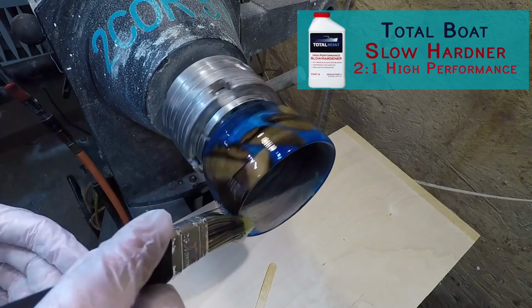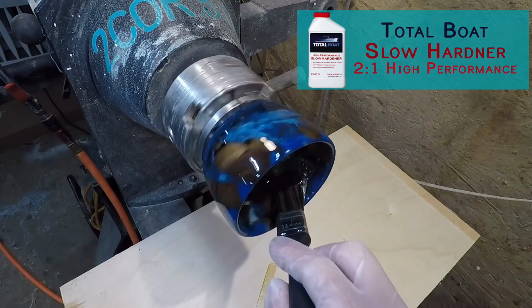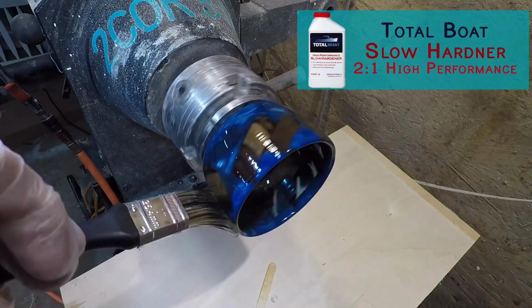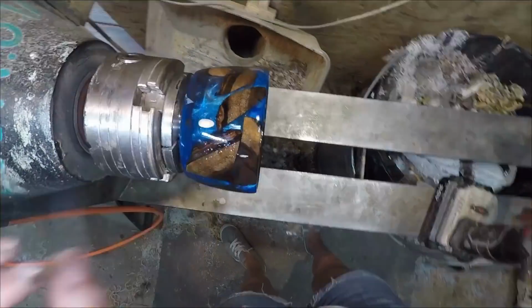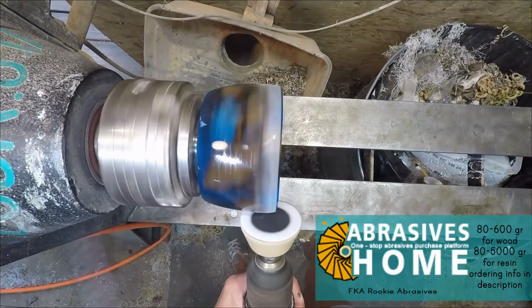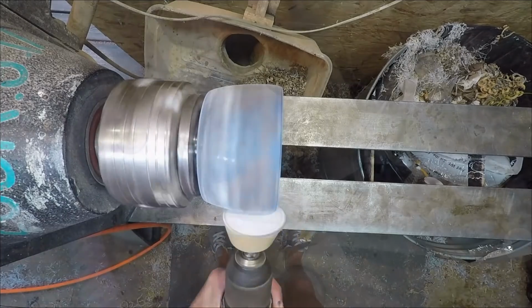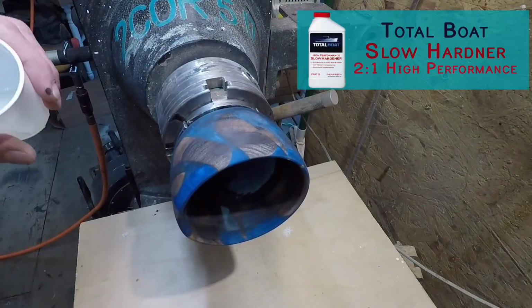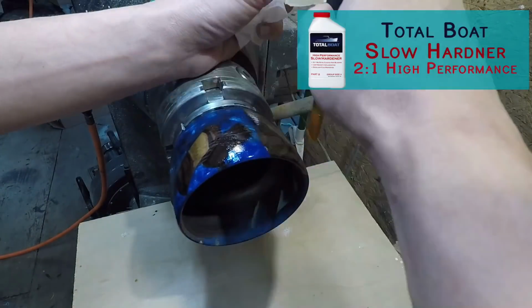When I do wood pieces and I use resin as a finish, a lot of times the wood has air in it, so it wants to come to the surface as the resin's curing. So most of the time you get these little bubbles right over the top of where the wood is at. And it's not a horrible thing to happen, because a lot of times, especially for the shaving set, or depending on what piece I'm using, I like that depth. I like the depth that the extra coat gives it. So I always just prepare myself to do 2 coats.